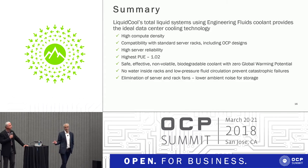While the fluid cost question always comes up, if you think about a completely liquid-cooled rack, you start to think differently — like you don't need fans, so that cost comes out. There are questions about the CRAC units themselves and how you could eliminate those in a data hall. You really need to look at the complete infrastructure — a complete and total picture of the total cost of the data hall from infrastructure all the way to the rack — to effectively help make that decision.